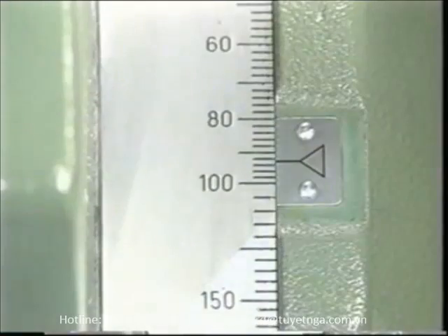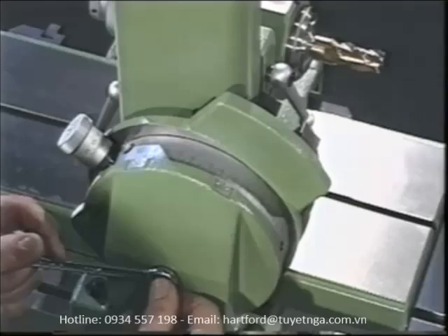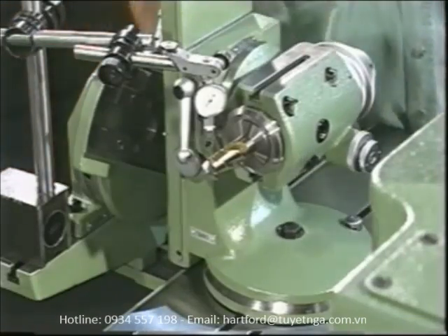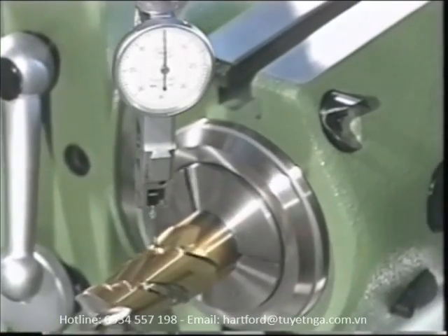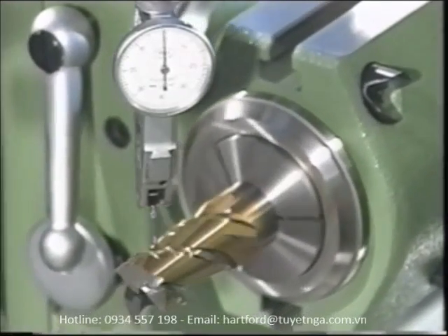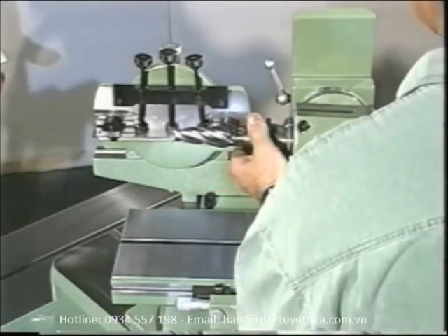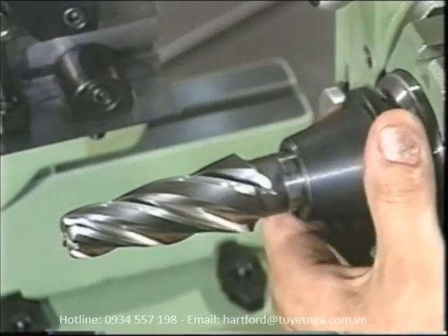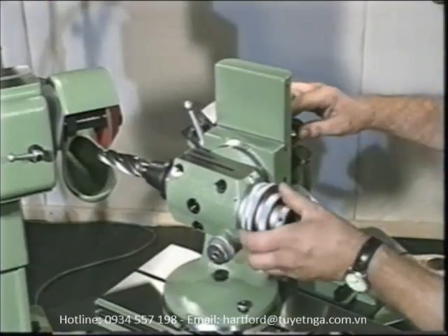The lead range is from zero to infinity and depends on the inclination of the sine bar. A known spiral lead can easily be set using the scale in the spiral and relief grinding attachment. When the spiral lead is unknown, you can determine it within a few seconds using a dial indicator. Until now, tapered tools with a constant spiral angle could not be ground on manual tool grinding machines.